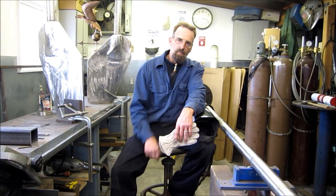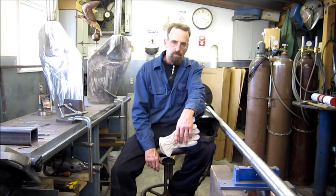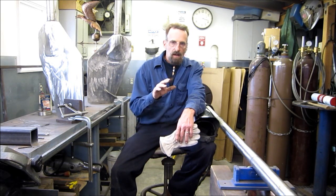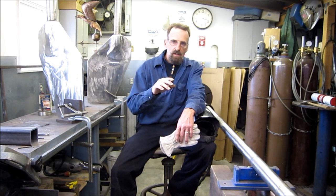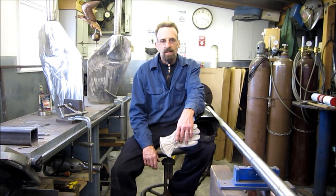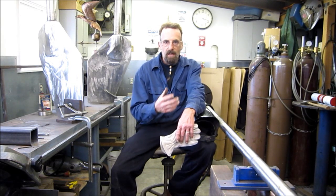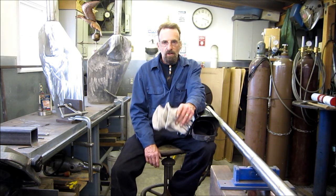The type of buildups I'm doing here — building up the material and remachining — requires a lot of welding knowledge. You've got to learn to go against it defensively and offensively, learning techniques of preheat, inter-pass temperatures, post-heat, and all of those things. I want to promote another website that I think deserves it: weldingtipsandtricks.com.